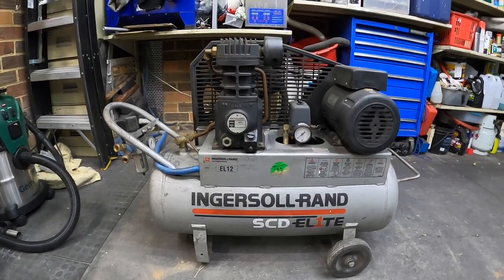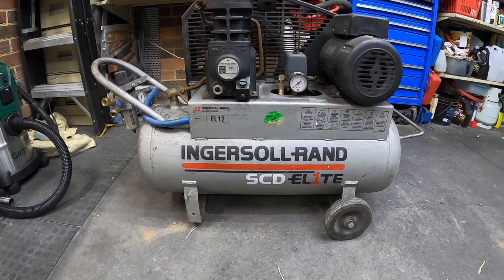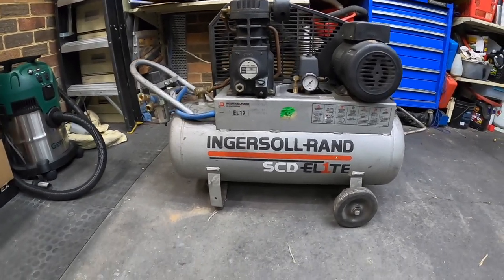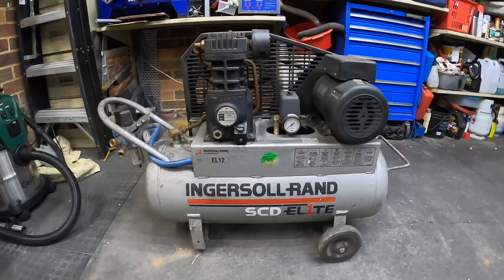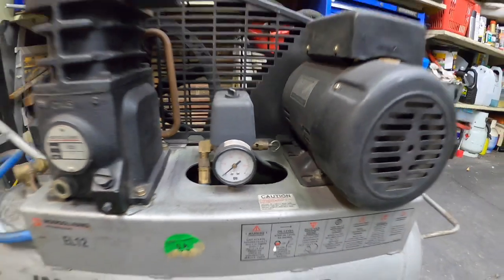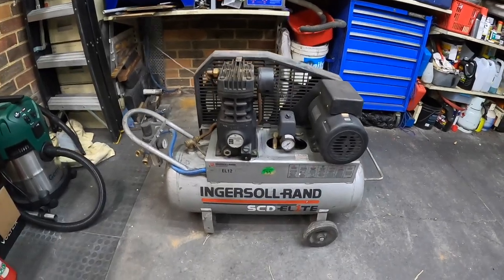This isn't the standard video I usually do. I'm having problems with my old Ingersoll. She's been a bloody workhorse between sandblasting, spraying, everything else that I've hit it with. I brought this thing back in 2000 and she's decided that she won't get up to pressure anymore. She goes up to about 80 psi on the gauge and that's it, which is not really good enough for sandblasting anymore. I'm starting to struggle with spraying.